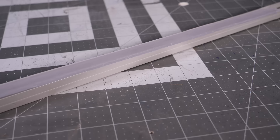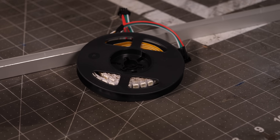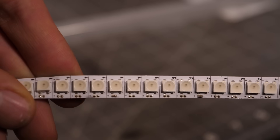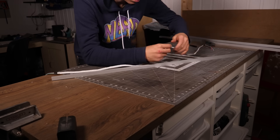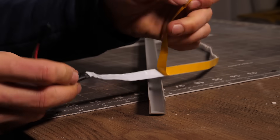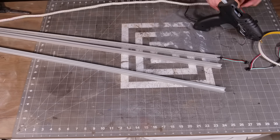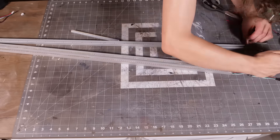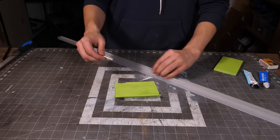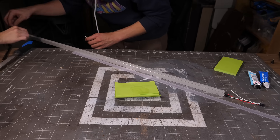Now we can move on to the LED strips. In this project I will be using quite a few components — I will put a link for all of them in the description box of this video. This is an individual addressable RGB strip with 144 LEDs per meter. All it basically means is that each individual LED can have a different color than its neighbor, which is quite handy for cool light effects. With the adhesive that comes on the back of the strips and some extra hot glue for good measure, I can secure the LED strips to the bottom of the aluminium channels. I'm also cutting off the cables on one side. Now I'm going to use quick drying epoxy glue to secure the acrylic to the top of the aluminium, and Martina helped me out with that.